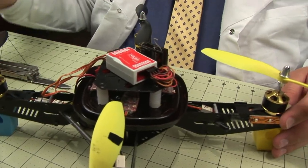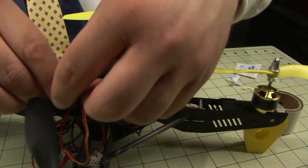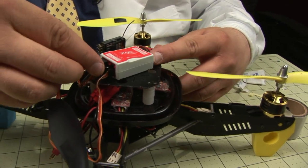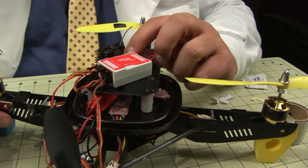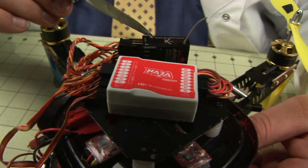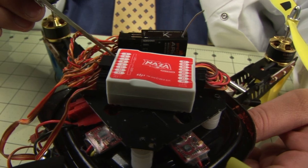On the other side, we have to hook our small wires to the receiver. That was the AUX1 connector, which I'm hooking to the X1 on the brain. The X1 will be used to make adjustments to the flight control system — we're going to bind that to the small knob on the DX8 transmitter. On the receiver, these correspond: A for aileron, E for elevator, T for throttle, R for rudder.